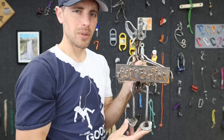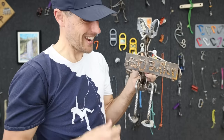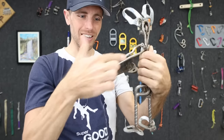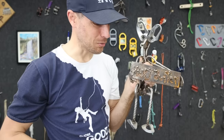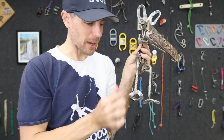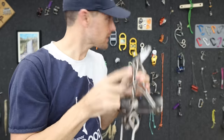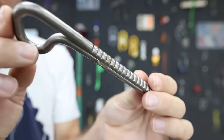The reason is because you need some way for the epoxy to hold on. You can see how the wave bolts pulled out a little bit. These solid-leg bolts have a spiral in them, and the twist bolt has a twist as the spine, while the titanium bolt has notches in it. Epoxy or vinyl ester — whatever glue you're using — doesn't stick to metal at all. It has to have some mechanical way to hang on, whether it's the shape or the notches.